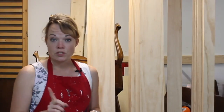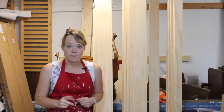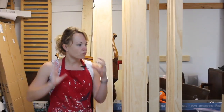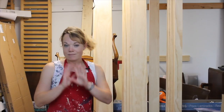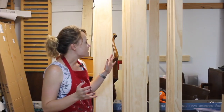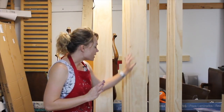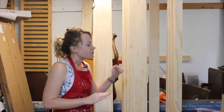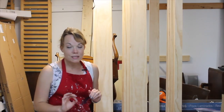First things first, let's talk about what kind of wood you're gonna use to build your barn door. The more rustic barn wood, rough kind of wood — it looks really cool but it's actually harder to work with. So for this barn door we're gonna use select pine from the lumber store — I bought it at Home Depot. It's really nice, straight pine, generally not a lot of knots, and that's gonna give us a really nice finished product that's easier to work with.